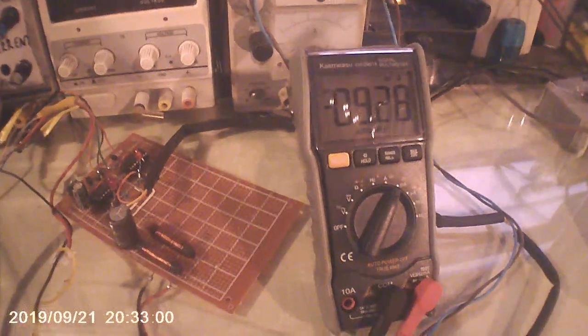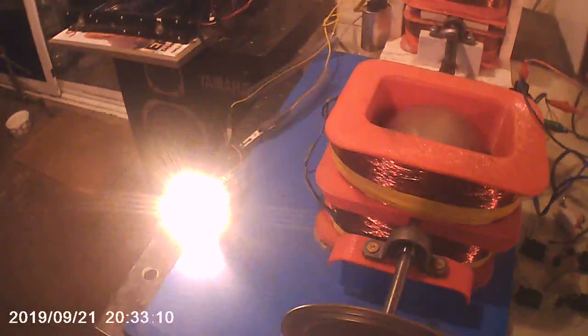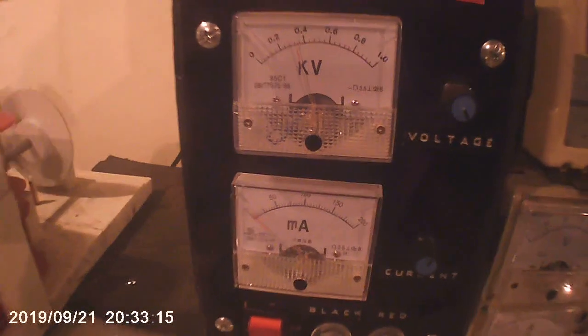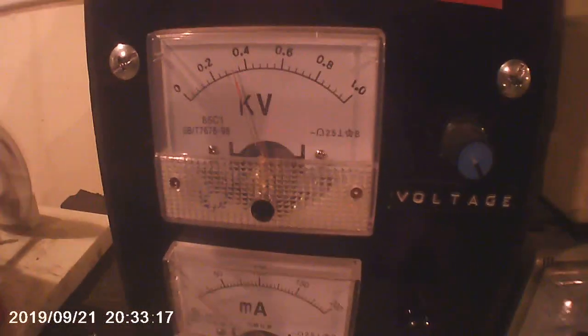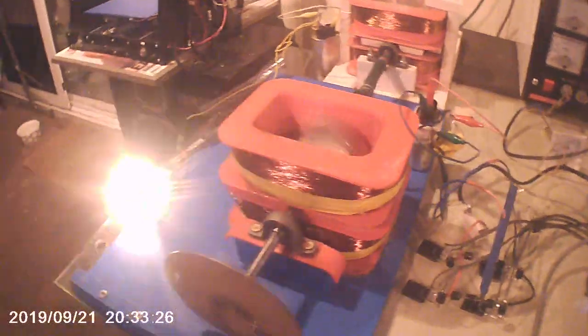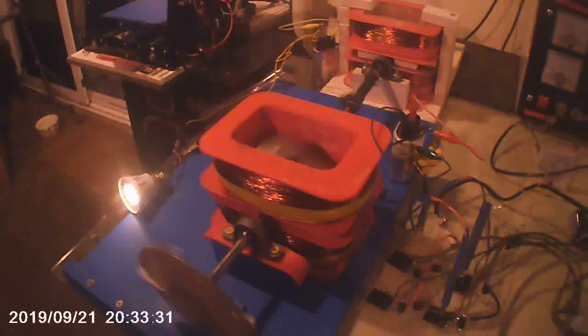For example, the input power has gone up to 9 milliamps. I'll take my hand off the shaft — I wasn't squeezing very hard. But the power running this light load now — it's only a 5 watt globe and it's not even all the way on — but it's running at about 360 volts and 7 milliamps. So that's just under 3 watts. It's about 3 watts of light globe power.